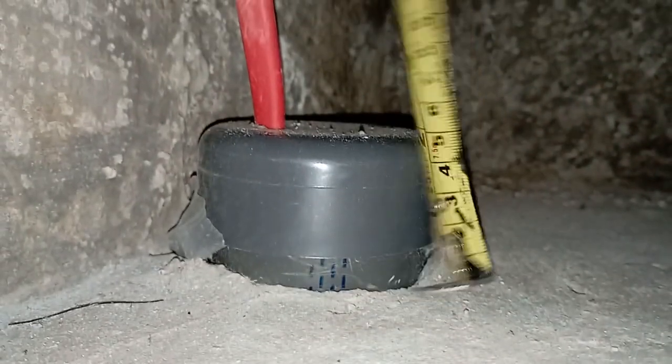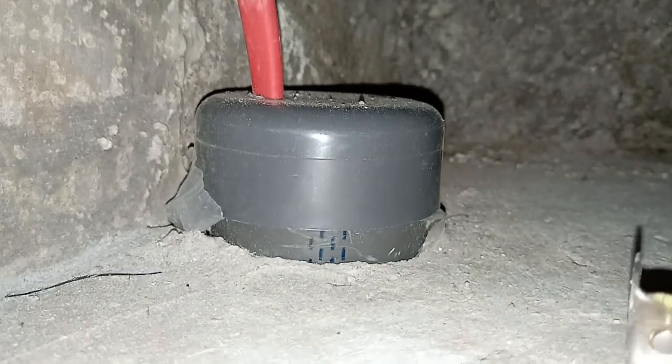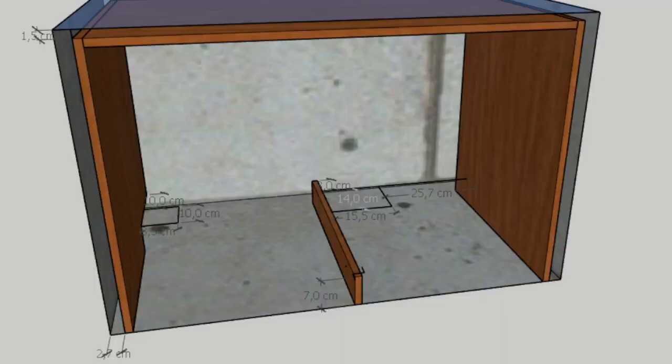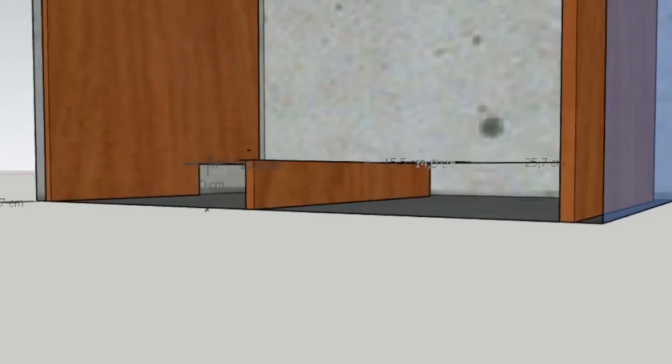The floor is uneven because there is a pipe, so the height must be adjusted to 7 centimeters, but the standard size of the kitchen set makers is up to 5 centimeters high. Given a middle retainer like this so that if the load is too excessive it will not make the wood bend.